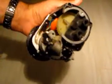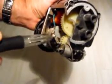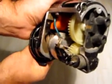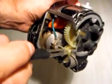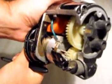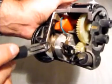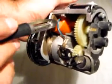There's only two visible. There's a little cam in there - so that's how that works. Now here we also have a set of contact points in there that are opened and closed by a little cam that's on the end of, that's just inside this small white nylon wheel. So there's a little cam in there that opens and closes the contact points, and that is so that we only get a pulse of electricity through the primary coils when the north and south magnetic poles are at the best position to generate this primary current.